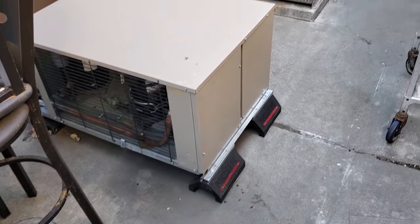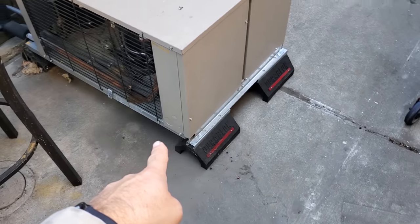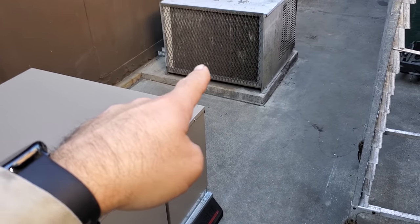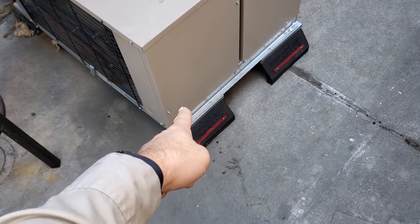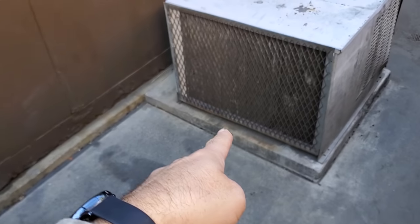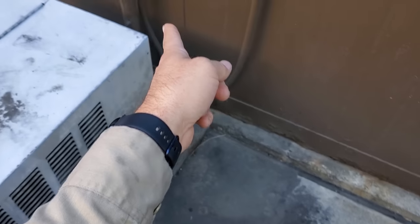I've got to figure this out because this is the walk-in freezer equipment. The problem is if we put the unit just like this one, then the discharge air is going to blow right into the condenser. And the access panel is in the same location as this unit. So if we flip it the other way, like this unit right here, then the access panel would be up against the wall and you wouldn't be able to get to it.